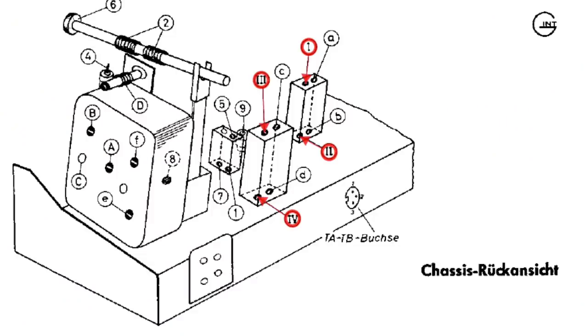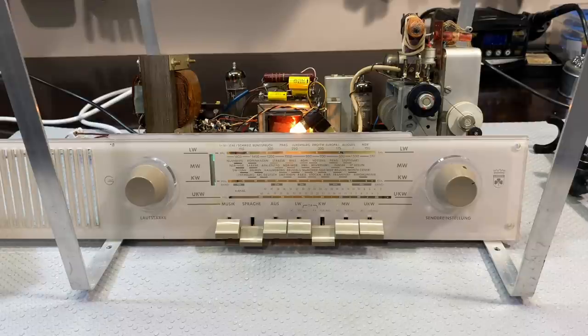What we can see on the diagram is coils 1, 2, 3, and 4 — two at the top, two at the bottom. They are the ones marked in red; they've got red cores on the actual transformers. The IF frequency for the set is 460 kilohertz.